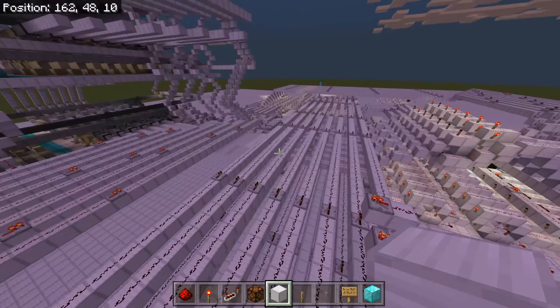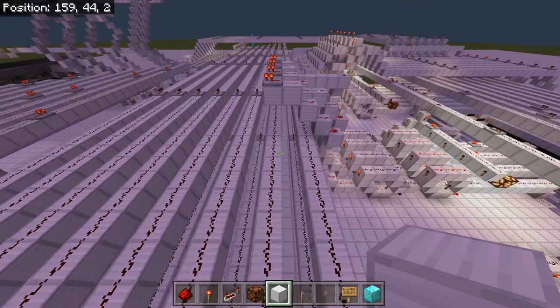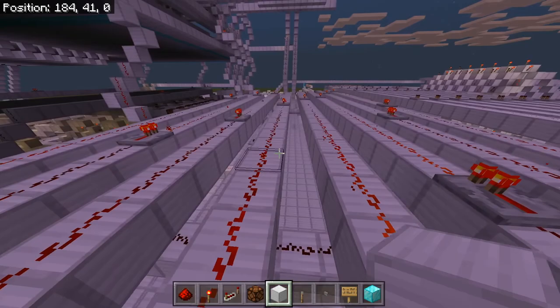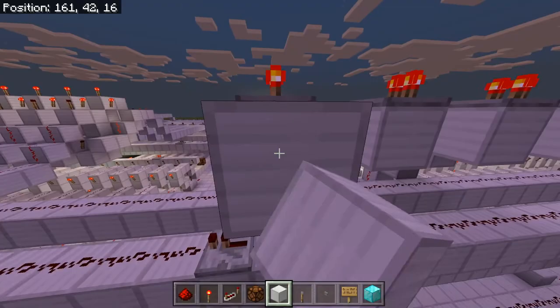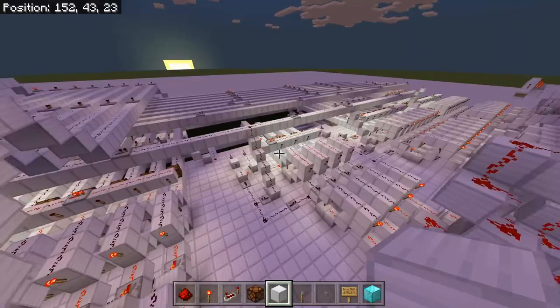It's going to take up a lot of space, but this is 8 wide, but we're losing 2 of them, so 6, 7, 8, 9, 10, 11, 12, 13, 14, 15, 16. So it's going to take us all the way over to this level here, basically, to do this decode. And what I'd like is to have these control signals above the thing we're decoding. That will make it easier.